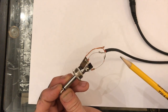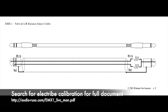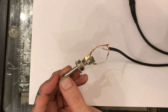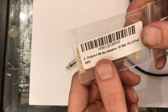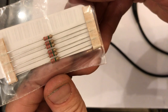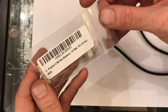I couldn't find any good videos on how to make the cable — there's a diagram and stuff like that, but this is a good how-to video on how to do it. Also, if you can't find these exact resistors, what I did learn is the 2.2 mega ohm rating. All resistors have a color coding on them. You're going to be looking for red, red, green, gold — that'll tell you you've got the right resistor: 2.2 mega ohm resistors.